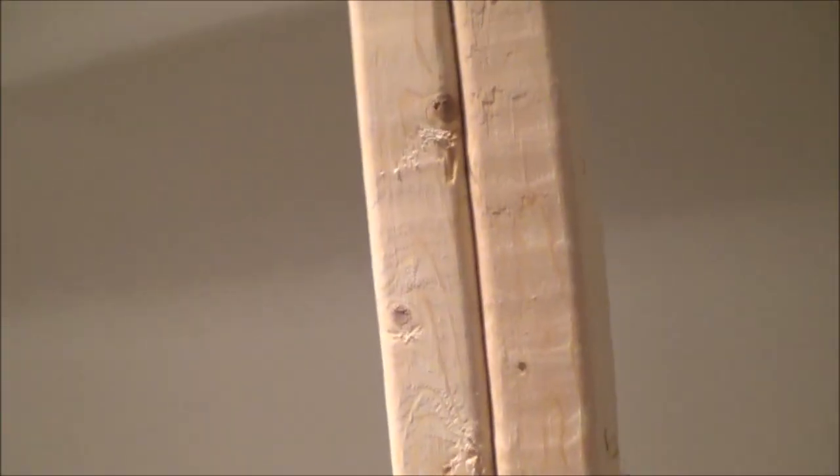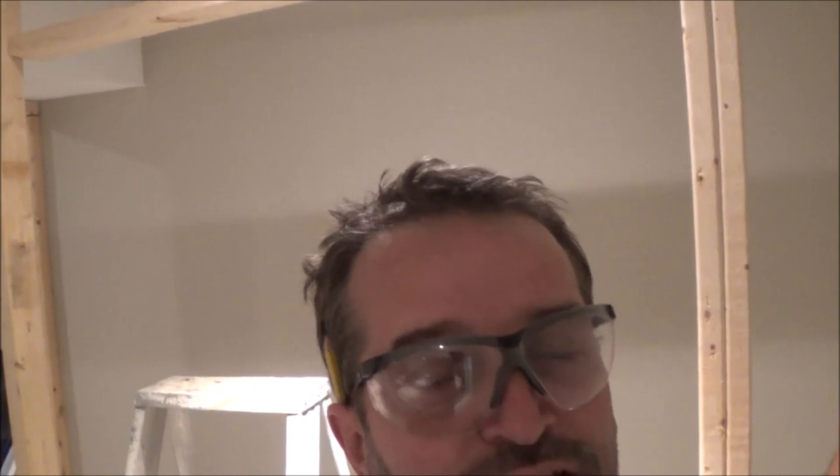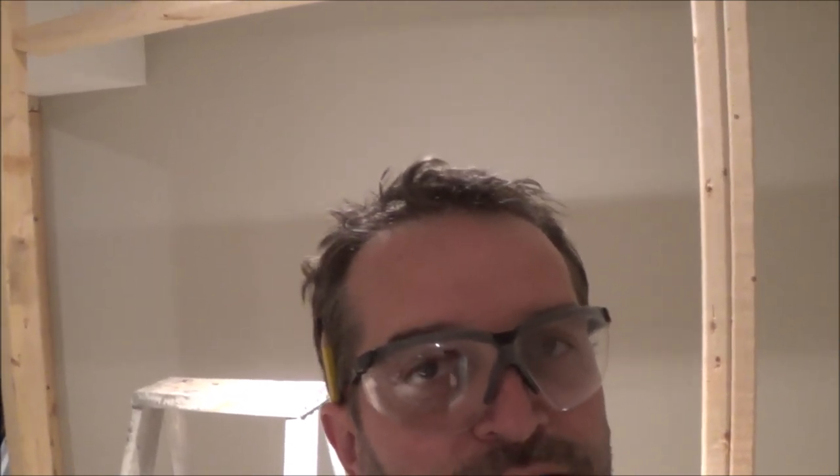Here's something you can run into - crooked boards. These two boards are shouldering each other and are lined up pretty good at the bottom, but near the top a big space opens up because the boards are twisted. Looking from the other side, you start seeing a gap there too. We're going to close those spaces with C-clamps just to make them perfect. In framing you don't really have to be perfect - you can be within a quarter inch here or there - but where you've got two pieces side by side shouldering each other, they need to be flush or the drywall won't fit properly.